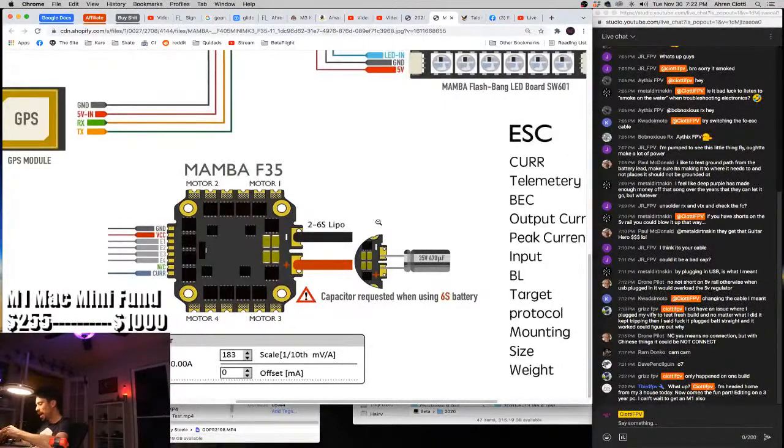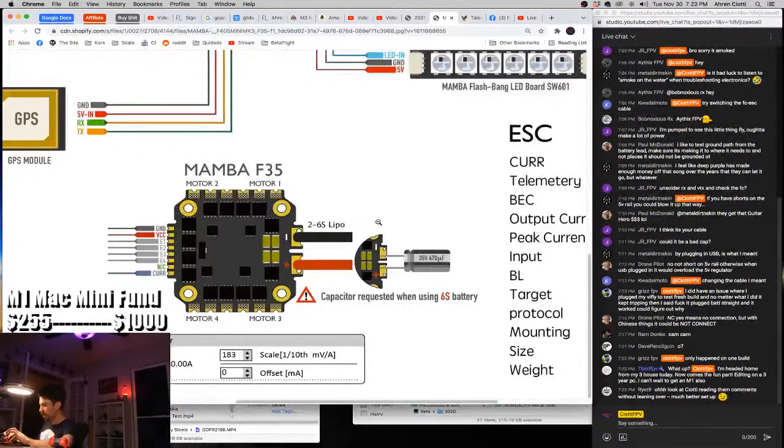Okay. Yeah, I'm really tempted to just plug a battery in. But, I mean, that's just a silly thing to do with the Vi-Fly tripping like this. It's not that much work to desolder a couple of these peripherals to see if we can isolate it. But if I desolder these 3 power leads and nothing changes, at that point I guess I just put full battery voltage to it. At that point, it's kind of like, well, I've checked everything. And if at that point the flight controller blows up, then I feel like it was already blown up, you know? Like, what the hell else could we do once we've disconnected each of the things.